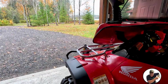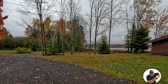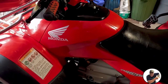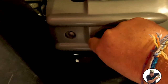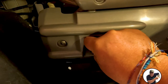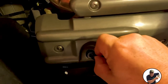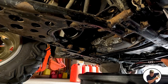Now that the machine has been running about five minutes, we're going to start taking out the oil. The first thing we want to do is locate the dipstick, which is right here on my machine. Taking the dipstick out is going to allow the oil to flow out much easier — now that it's nice and hot it would otherwise create a vacuum. Then we'll go take a look at the drain plug.